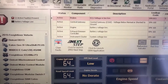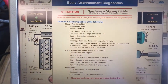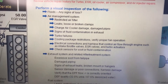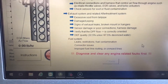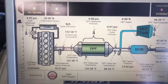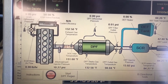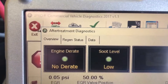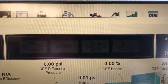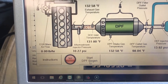I'll show you what that looks like. We're not going to fire this one up, but I want to show you the menus and how it flows. Right away it says, before you do anything, make sure you go inspect all of these things. It pauses here on purpose so it forces your technician to go do it. We hit close, and now we have this great looking picture of the DPF and the emission system with all the sensor values. It tells us our soot level, if our engine's derated, if we're inhibited at all, or if any emission lights are on. All you would do to start it is go down to start DPF regen, and away you'd go.